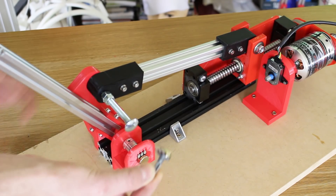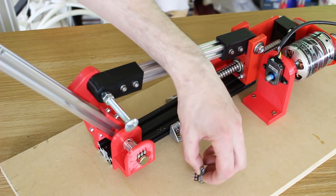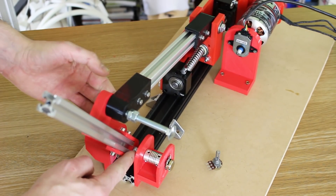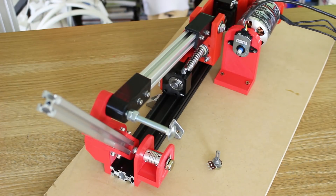We've got a lever that moves the joint and a feedback pot on here — just a 99p linear potentiometer, I think it's 10K or 100K. It's not an ideal thing to use and I wouldn't use them on OpenDog, but it'll do fine for testing. It just measures the actual angle of this joint with a little coupler. There are no bearings, it's just a piece of studding through plastic bolted onto the joint — not an ideal arrangement, just a test rig.